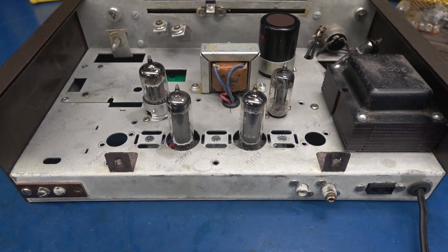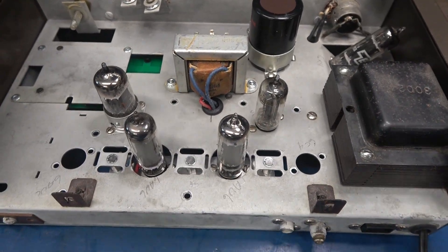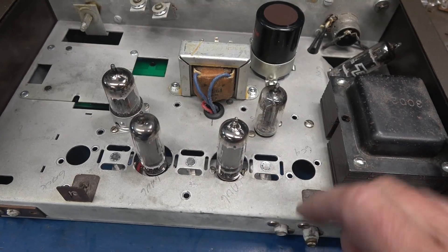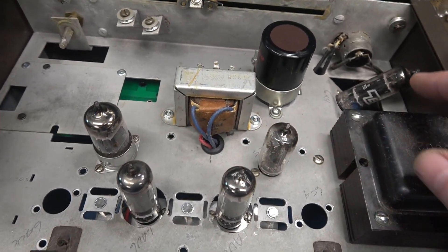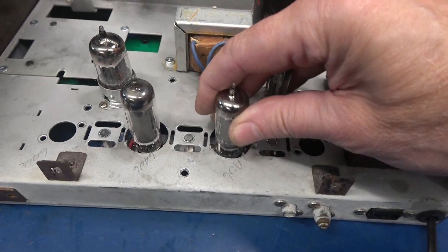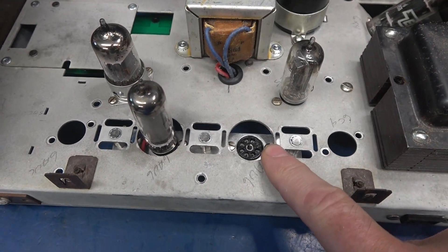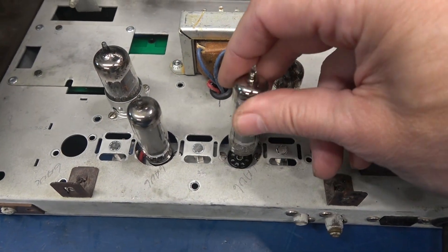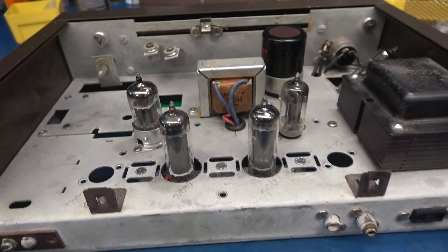Here's an update on the ICO tuner being transformed into a guitar amp. These are my output tubes — a pair of 6AQ5s — my inverter and a 12AX7 preamp, and we're still going to use that 6X4 rectifier. I recessed the tube sockets by punching a one-inch hole and landing a plate on standoffs, so now the tubes will have no problem clearing the cabinet top.